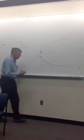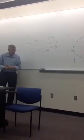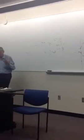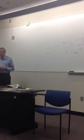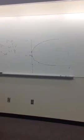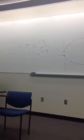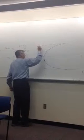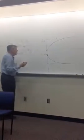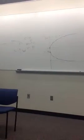Well, the current is zero, we're not changing any of the charge on there, therefore the voltage can't change, so it's just going to stay like that forever. So that's our hand-waving derivation of what the waveform should look like. This should end up, in my example, at 10 volts, which is my battery.